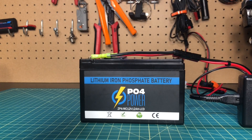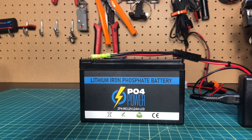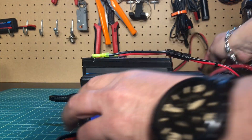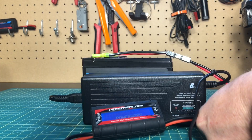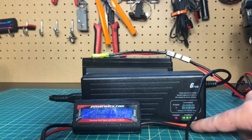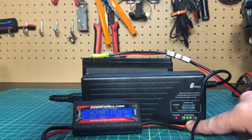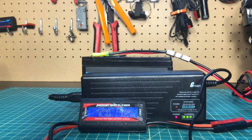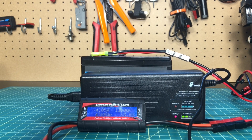Let's see if we can get a little more current. Being a more empty battery, that might have something to do with it. We're going to use our PowerWorks watt meter to see what we can pull. Plug this in and we can see we've got an empty battery on the charger — we're pulling 4.85 amps out of the charger. Still not seeing that 6 amp capacity, but let's let this run and see how long it takes.